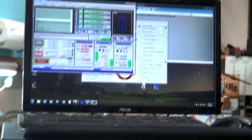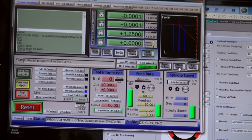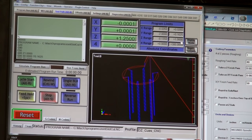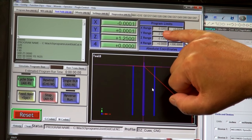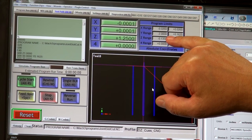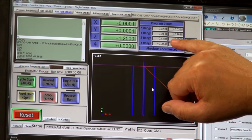You know, before I start that, let me double check this thing here. Now if I go into toolpaths, you generate the toolpath. First of all, I look at the program limits. My X varies plus or minus 26 thousandths. That looks safe. The Y range, it goes plus 162, which is basically half of this. It's a little over the cutter diameter. I don't know where that number comes from.